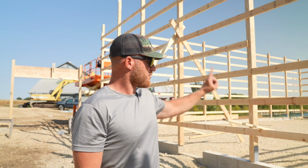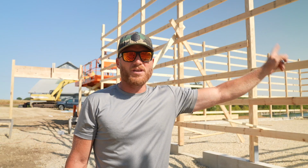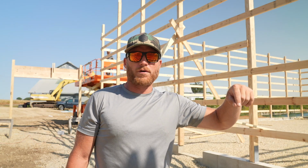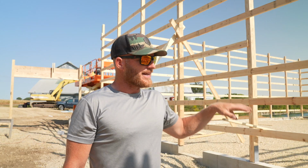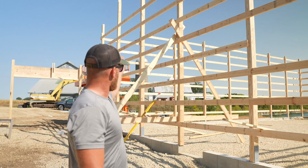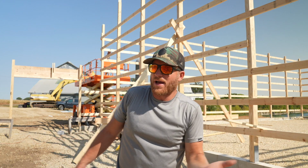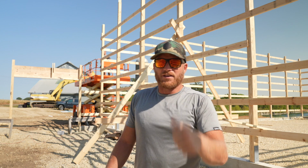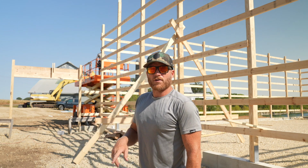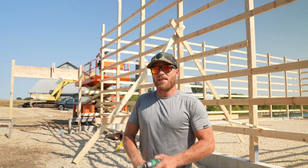That is just a temporary brace, and the reason this wall is temporarily braced versus the other ones is because I don't have the proper bolts for the anchors that go into the foundation. It's Tapconned in. It's still pretty solid, but I would not want it to go through a big storm without some bracing. So it's braced on the corners to our walls, and that temporary brace. Now I'm not too worried, it's not going anywhere. Everything else is good to go. We're gonna have to get out of here for the weekend. We got one more garage door to frame and finish off, and then we'll be ready for trusses.